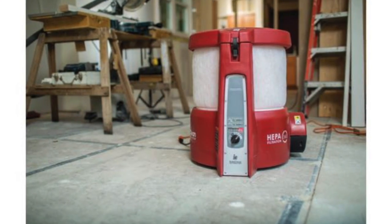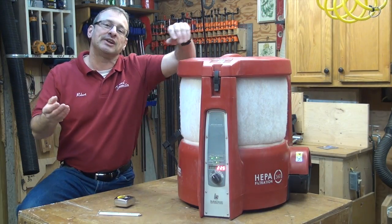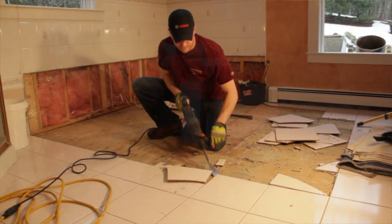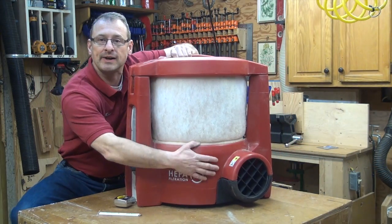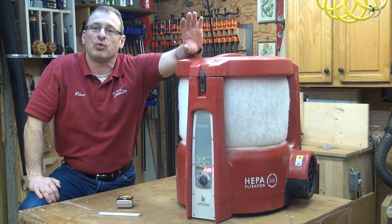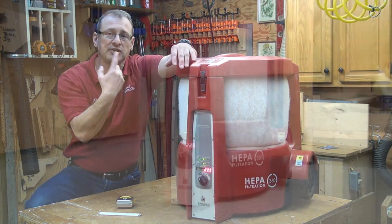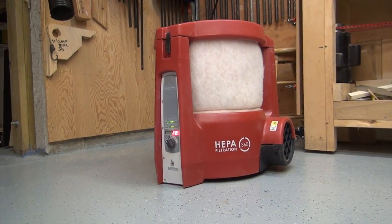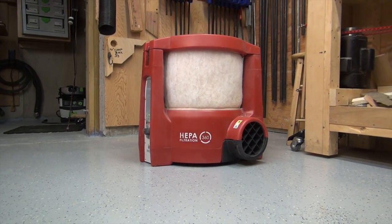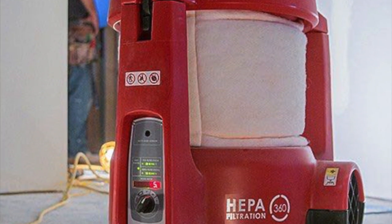You can use this two ways. You can set it up in the room to basically scrub the air and then recirculate it back into the room, and that's how we use it mostly in our remodels — working in a bathroom or something. Or you can set this up with a hose on the back end here and create negative pressure, sucking the air right out of the workspace to create a negative pressure environment. The 360-degree design pulls air from all sides and will give you six air exchanges on the high setting for a 6,000 cubic foot room. That's a lot of air, and that's a lot of scrubbing.